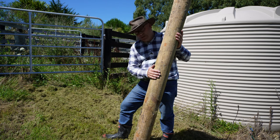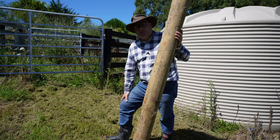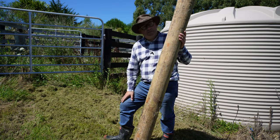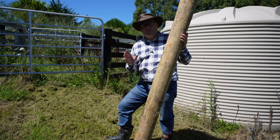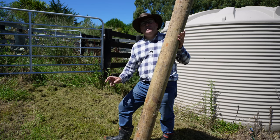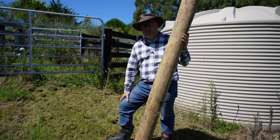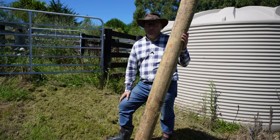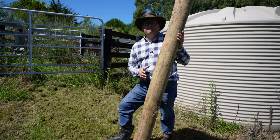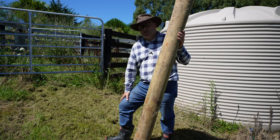We've chosen a number one here for a number of reasons. It's not going to have the sideways strength, but we want to distribute the load as much as we can at the base. There's quite a heavy gate on here, so we're going to want a fair bit of tension on this. This is also a high pressure zone for the animals — depending on the number of animals that might be up against the fence at any one time and their desire to push through, it increases the overall potential for pressure against it. As soon as you create something like a race and you're trying to push the alpaca along it, they're going to be looking for different escape paths. In those situations, you're going to want to make sure these fences are really strong.